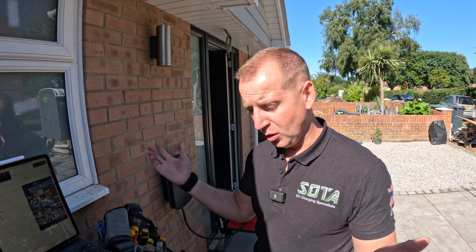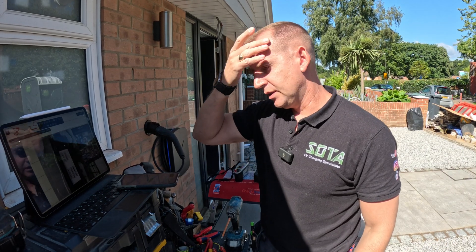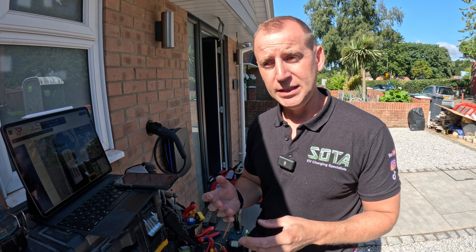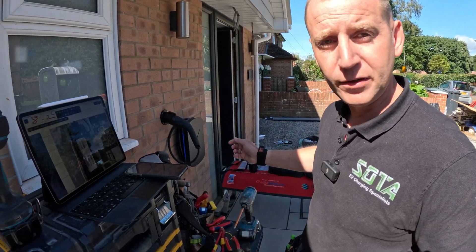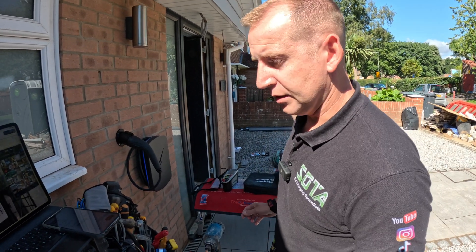What I like to do now is coil that cable and mount the holster, get that in position first before carrying out my commissioning, then put away all my kit. The charger has something called a random delay — when you plug your car in there'll be a random delay of between one second and ten minutes — and that interferes with my testing. So I've connected the Hypervolt to my phone to override that. I can tell it's connected because on the charger there's a solid blue light around it, meaning it's successfully connected to the internet.